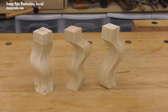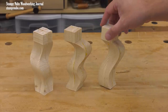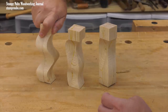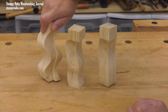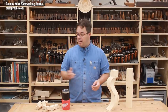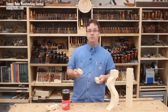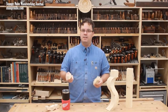The template-matched legs feature different shapes — one has a foot that angles inward and the other has a foot that angles outward — but both curve on a single plane, visible from the side but not so much from the front. The blank made with two mismatched opposite-shape cuts curves along two planes, which you can see from all directions. With experimentation you can come up with your own unique designs, and you can experiment with little pieces of scrap in miniature — just pieces of 2x2 stock that help you wrap your head around the process and all the possibilities.